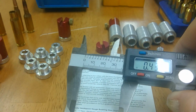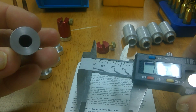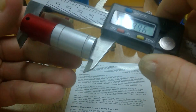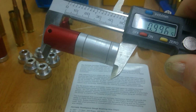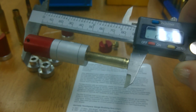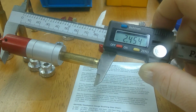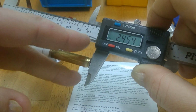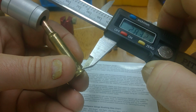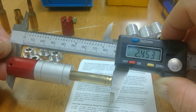Another piece of this kit are these shoulder gauges, right? So you put these on the jaws. Tighten that up. And now you can measure, if this is the right size. Yep. So now you can measure where the shoulder is of that cartridge. This one here is just a never-been-fired piece of 223 reference. This is actually where the rifling is on my 223 Ackley. But now we're measuring the shoulder. You'll notice that the whole bullet and the neck all go up inside of that tool. You square that off, and now you're measuring the distance of the shoulder, right?